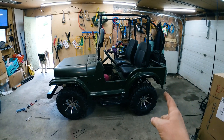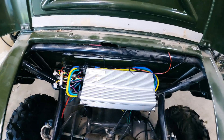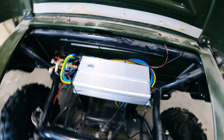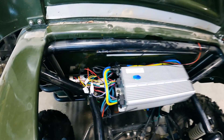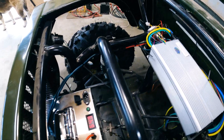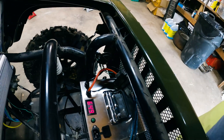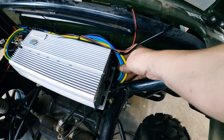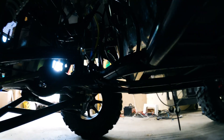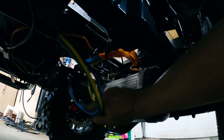As you can see, it drove around our whole block through the back alley. Now let's do a quick tour. Here is where we mounted the controller — a 3,000-watt controller. There's a rat's nest of wires we need to clean up, but I still need to do final wiring on all the auxiliary lights. The power wire runs over to the battery, which now reads 64.9 volts. The three motor wires run down here under the Jeep through a built-in raceway, and then at the back they tie into the motor itself.